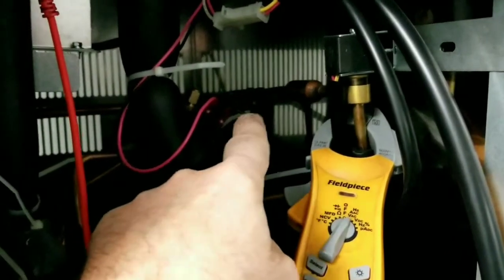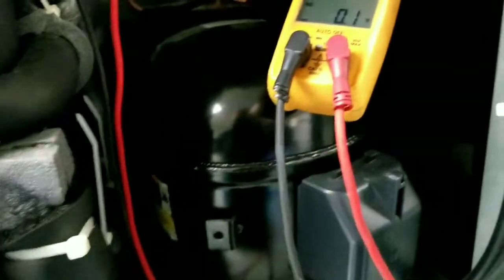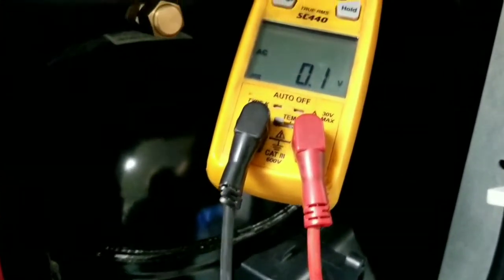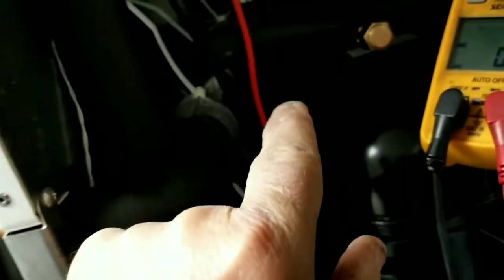Alright, now the compressor's on. We're going to start the hot gas valve. Is open. It's sending hot gas from the discharge line into this side of the TXV valve, into this line, and this line is warming up. Oh, the drain is getting louder in the back. Okay, cool. Now, this is what I want to see. Come on, hurry, get to 48 degrees. Well, actually, it's got to get to 48 degrees.